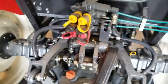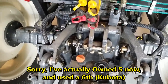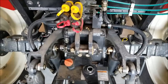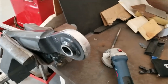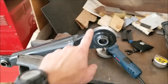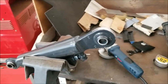That's the problem with all these tractor manufacturers' aftermarket things. A Cat 2 is not a Cat 2 is not a Cat 2. Everything has different tolerances, different variances. I've owned four different tractors now and used a fifth, and I see this all the time. It's frustrating. Linkages and stuff like this are not uniform — from tractor to tractor there will be variances. I knocked off some of the bottom and the end, but I doubt it's going to be enough. This is some pretty good steel because it's really hard to grind down. The one I ordered boasted about higher quality components. I need to grind off enough so it can swivel without causing excessive friction on the whole joint.